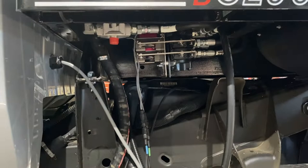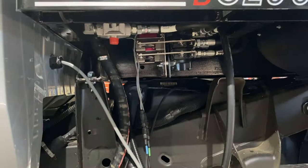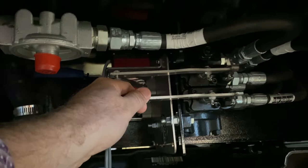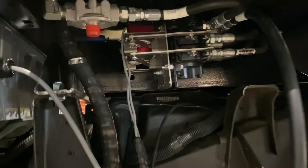This one is the hydro or the electric controls. You've got the little servos back here that run the hydraulic controls. Worse comes to worst, if your electronics just completely fail, you can reach in here and just manually operate these. Not ideal — you hope you don't have to ever do that — but if you're in a pinch, you can do that.